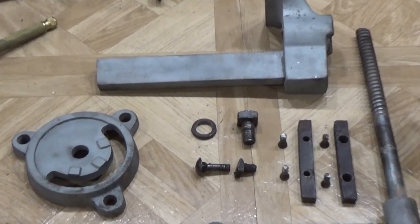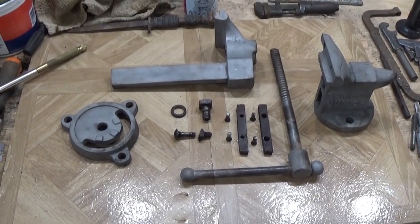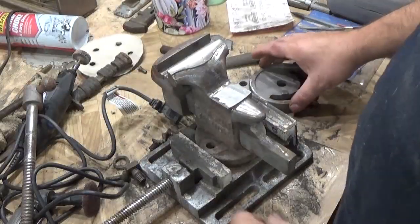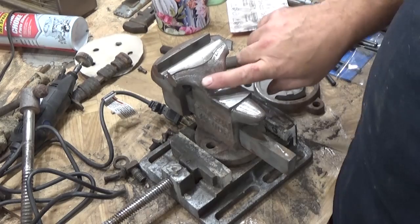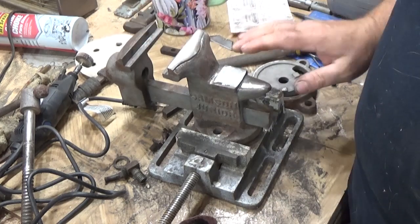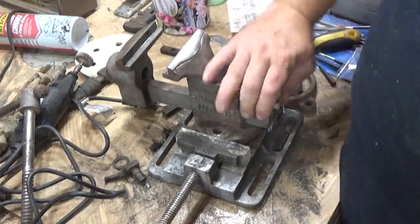Alright, we're back from sandblasting. I think overall we did okay. So I think it's pretty rough, and we are going to have to do quite a bit of finish work to get this looking the way it ought to. Alright YouTube, let's see if we can pick up where we left off. I've done a little bit to this. I brought out the die grinder and hit this back area. The casting on this side was way worse than the casting on this side. So this back piece is really secondary. Getting this, even that smooth, was quite the feat. So I'm trying to get this level and square, which is proving to be somewhat of a task, and this nice and rounded off.